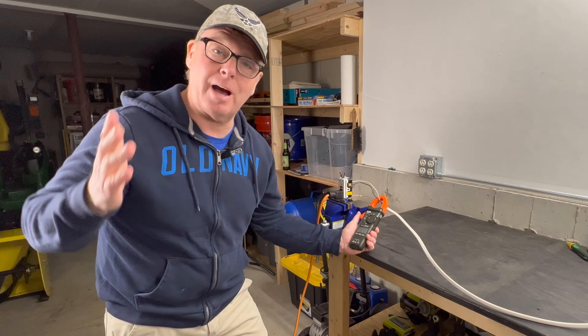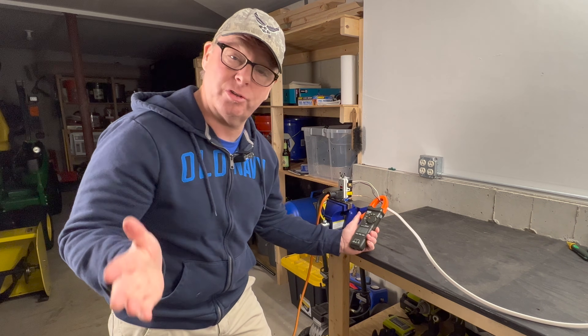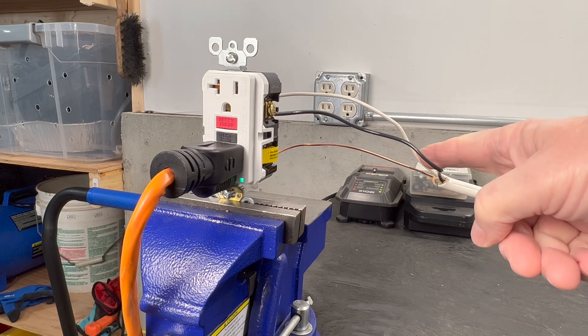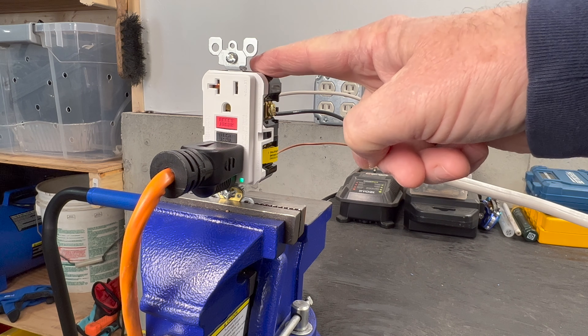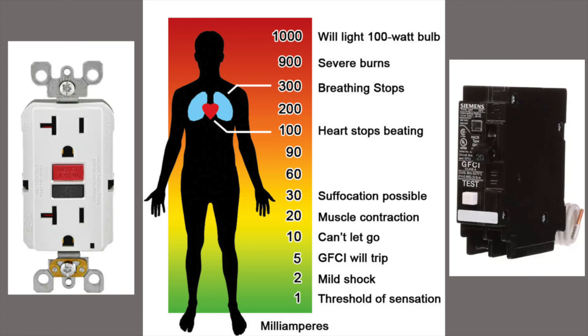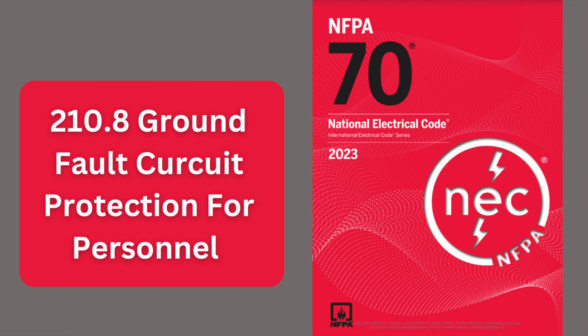And this is exactly how a GFCI monitors a circuit. If current on the hot flows through any path other than back on the neutral, the GFCI will detect the imbalance. And if it exceeds the 5 milliamp threshold, the GFCI will immediately trip, cutting off the flow of electricity to the fault. The 5 milliamp threshold is well below the level that can cause serious injury or death from electrical shock, and is the reason why they're required by code in high-risk locations.